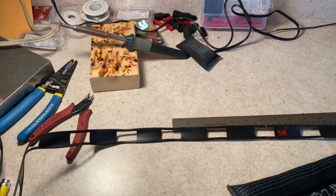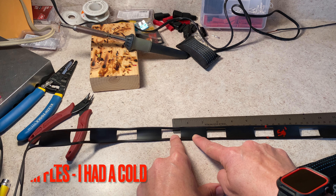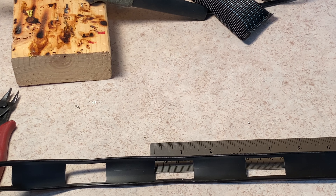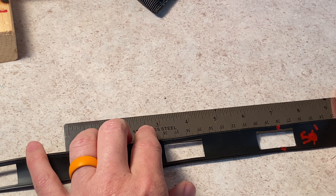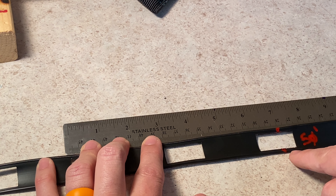With the magic of Google I converted the overall length of the antenna in centimeters to feet and inches — it ends up being 50 feet 4 inches and 0.92 of an inch. Since I have to solder the endpoints together, I'm going to cut it with seven inches to spare so I have a little bit of wiggle room. I marked the 50-foot mark with red paint so I have a good idea of where it's at.